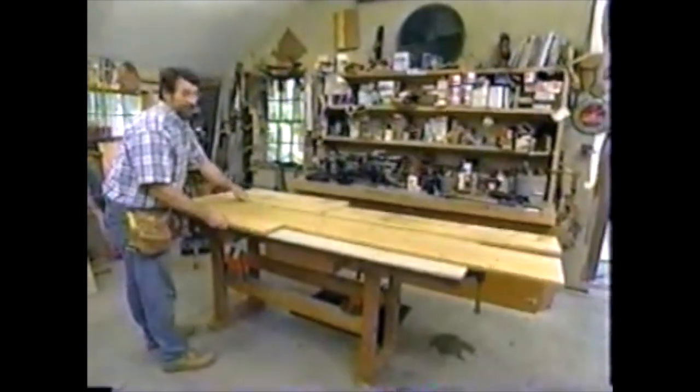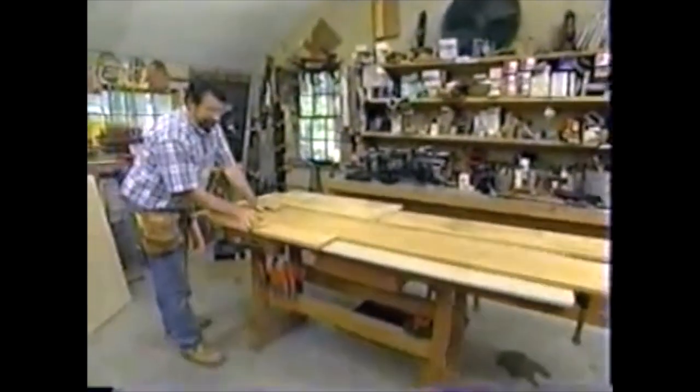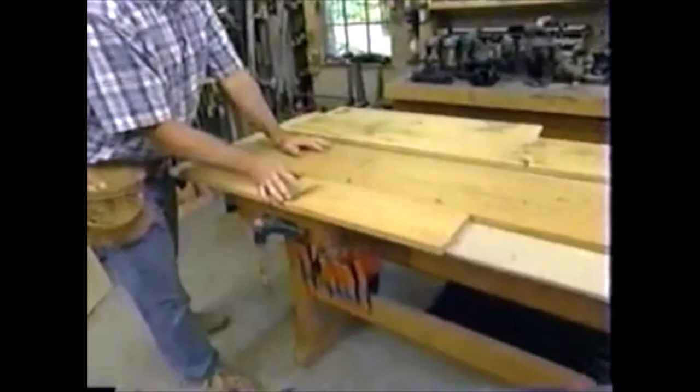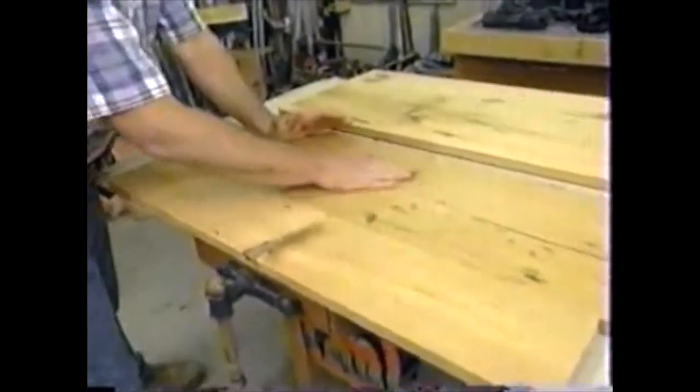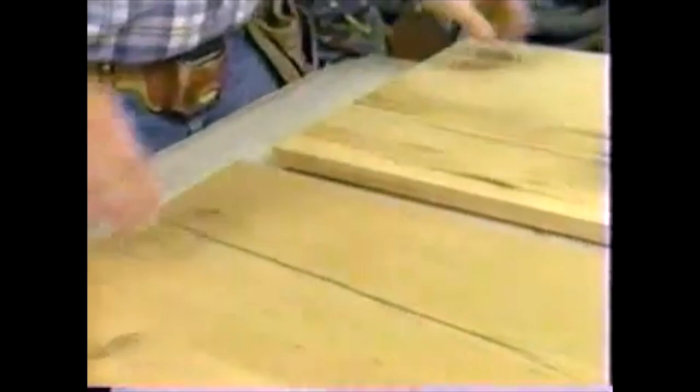These are the actual sides for the hutch — there's one long board and a narrower piece glued to the front with biscuits. I've sanded all the pieces smooth and even and cut them square. I've also laid out the locations of some dados needed for the fixed shelves and dust frames. To make the dados, I'm using the table saw with the stacked dado head cutter set to the right depth.